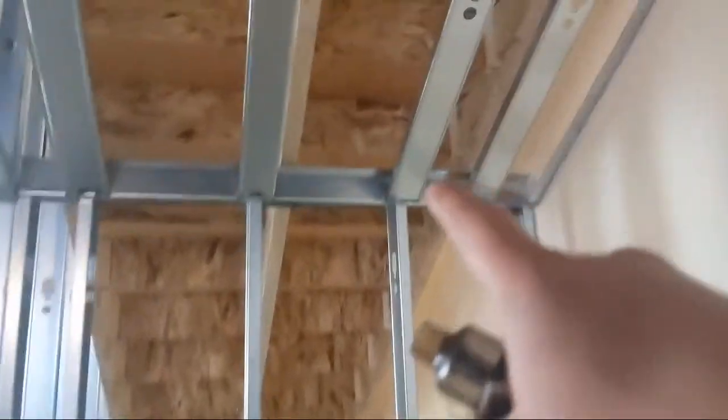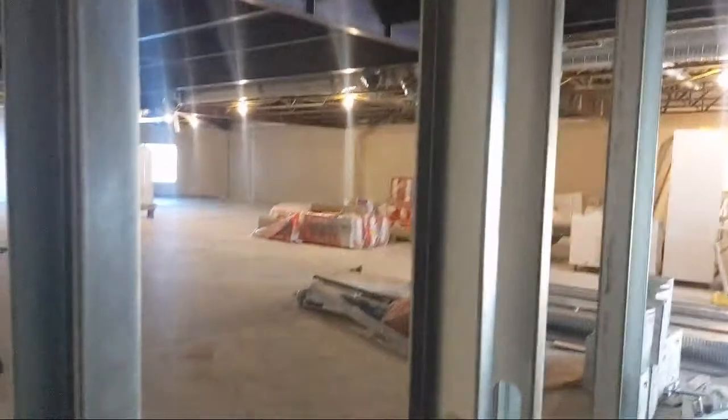And then that's done, right? This wall here, you just basically go up as high as you can. See how tight it is? I just lasered this elevation in, and just put that wall in like that. But also here, no slotted track, okay? This is standard track at the top and the bottom.